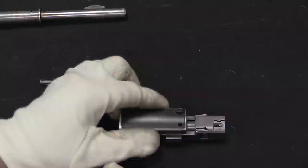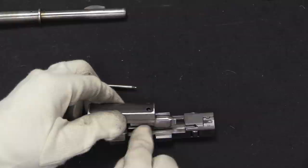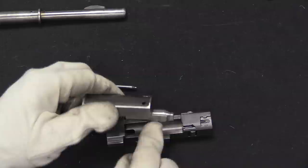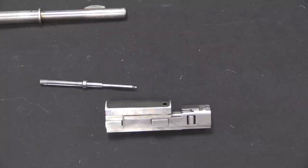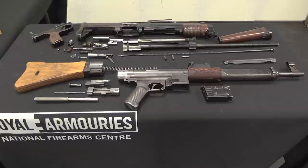The one big difference between the Gerät 06 and the EM-1 is that the EM-1 uses a long stroke gas piston, while the Gerät 06 uses a short stroke gas piston. That doesn't really affect the locking mechanism, but it's an interesting difference. The EM-1 is also a massively more complex firearm to manufacture. We'll lay out the EM-1 and the Gerät 06 here for your viewing pleasure. There will be a brief intermission while I spend approximately 12 hours figuring out how to reassemble the EM-1, and then we'll come back.